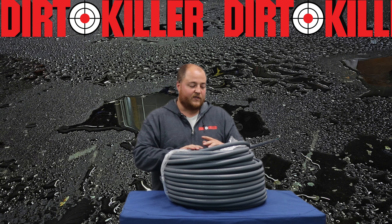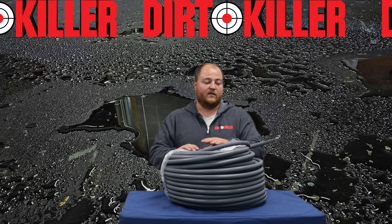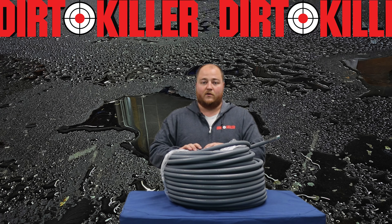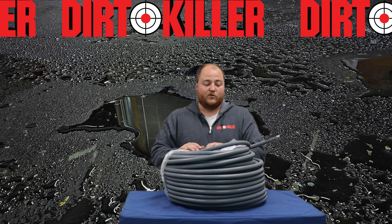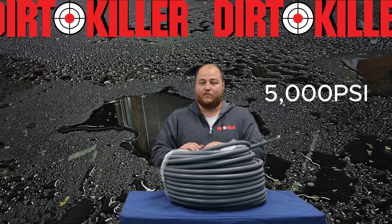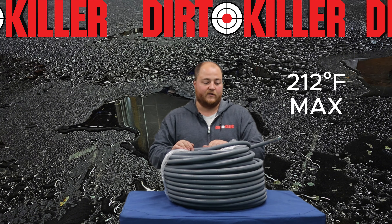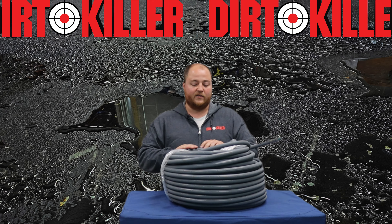The other application for this is shops where you need to make your own custom jumper lines. Think of hydraulic shops, high-pressure shops doing hose repairs, or really any place that installs pressure washing equipment. This is the type of hose that should be running for the majority of your jumper lines. Not only is it rated for 5,000 PSI with a 3-to-1 burst rating, but it can also go up to 212 degrees Fahrenheit, making it the perfect jumper line for all kinds of applications in this industry.